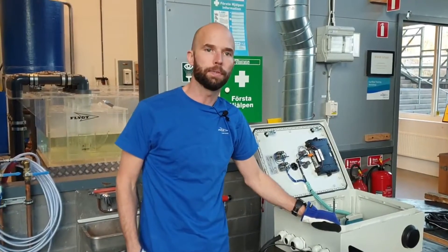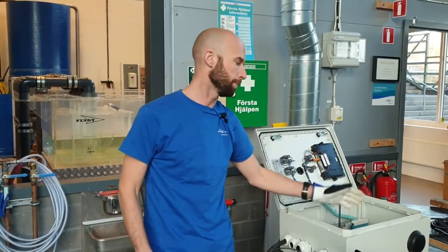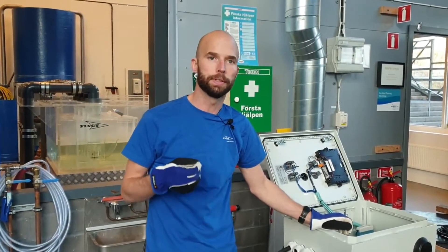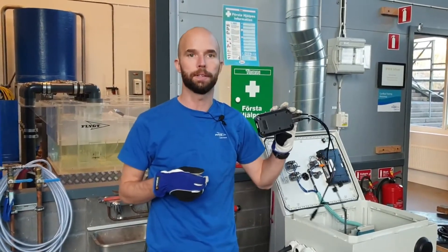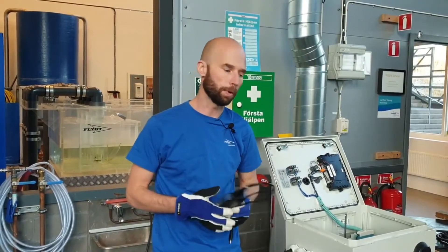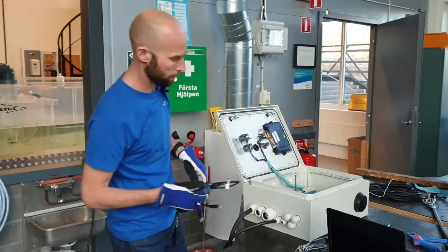In a Concerto end system, if you want to configure your pump, or if you have a Concerto DP or XPC system, you might want to troubleshoot the pump. For that we need the service tool DST. The PCM is a USB converter and the DST is the software that runs on the laptop. I will show you how to connect this service tool.